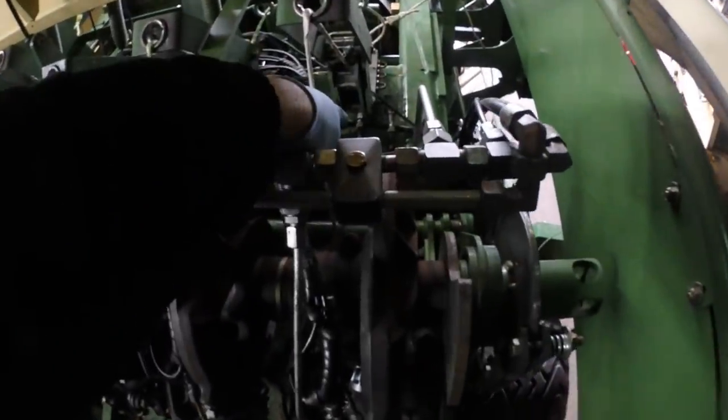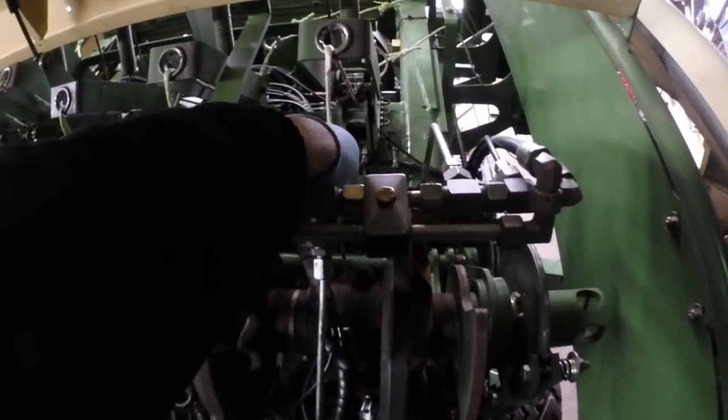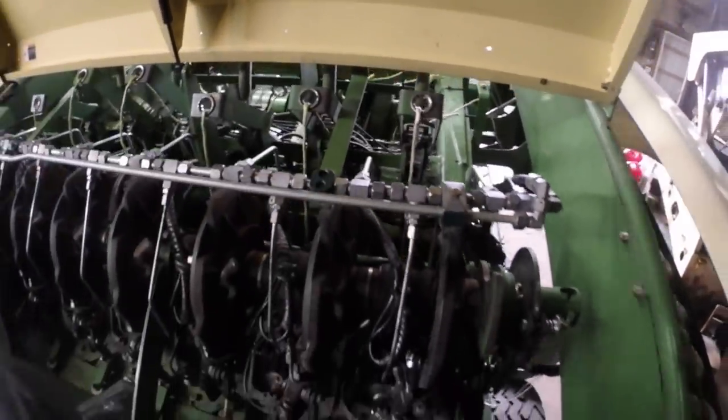New Holland was a little bit weird about it. Back here there was an overpressure for that, and you have to watch. If your grease isn't going down, it doesn't mean it's being more efficient, it just means that the grease isn't pumping. And you can get an airlock in there, and you have to actually break the airlock right there. There's where it goes into all those blocks, and let the air out, and then you can reprime the whole system.